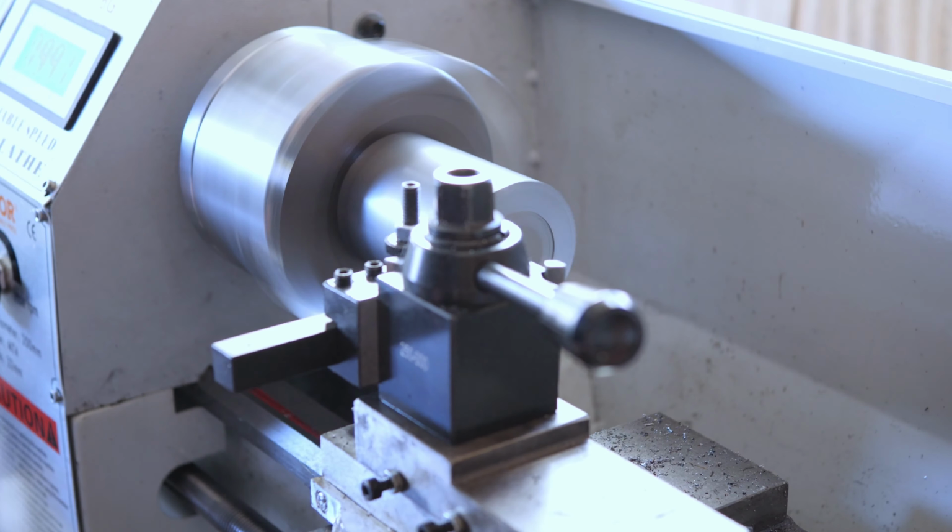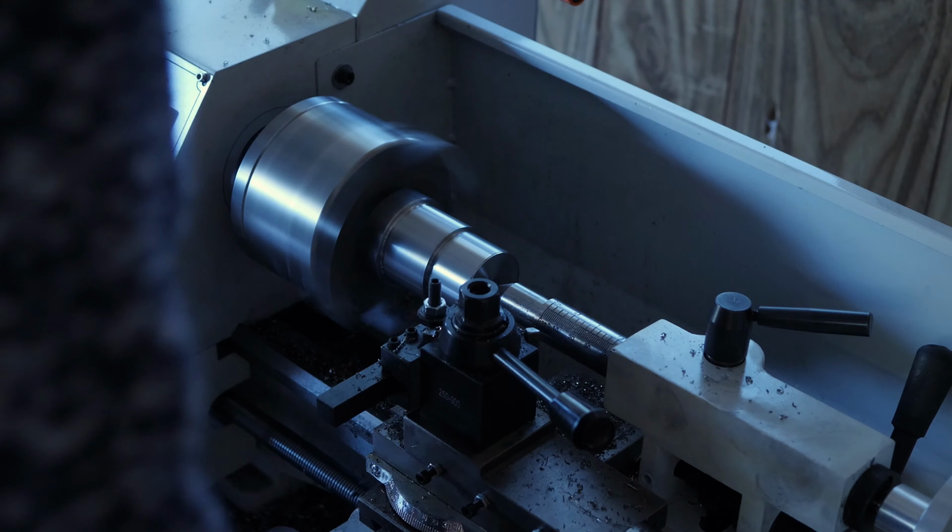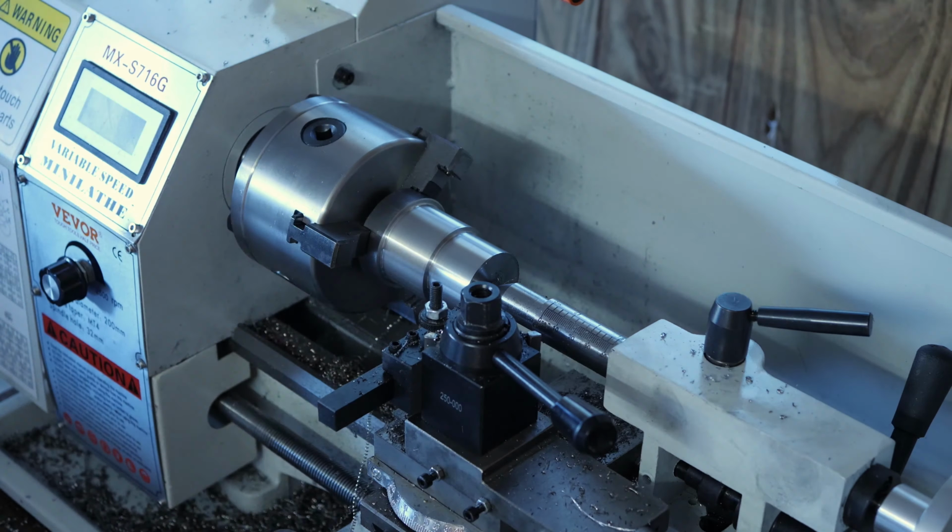But I did have a carbide insert holder tool for my lathe that was too big for my tool holders, so I decided to use the material from the Hemingway kit to make a fly cutter of my own design that incorporates that. My first step was to turn that material down. You're here for mill stuff and not lathe stuff, so I won't bore you too much with those details. It was just a facing operation, turning a couple of diameters and then chamfering with a file.